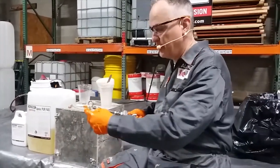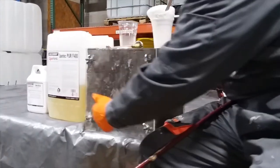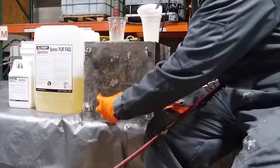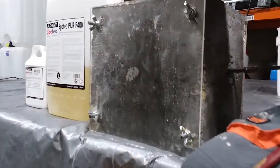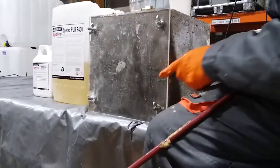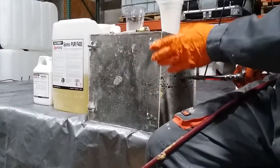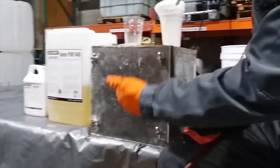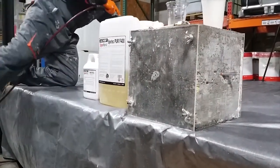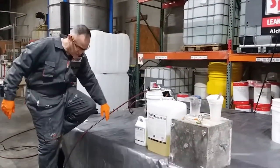I'm going to roll on and pump water. Water is lazy, so we're going to see a circle affected by gravity — it'll sag down. In our joint here, we didn't actually get water out to the far area — it drained down, which is typical because this is a pretty wide joint for crack injection. Water is lazy and travels down. I roll off, turn the pump off, and depressurize — a good practice when you're not using your pump for a bit. We don't want a pressurized pump laying around.